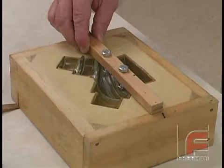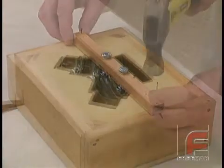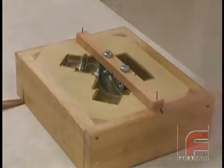Finally, we are ready to pour our core. We are suspending a bar with two bolts over our mold. The nuts will be cast in our core, and this will make demolding easier and enable us to suspend the core over the mold later.